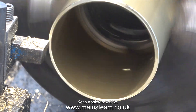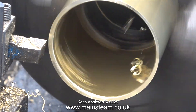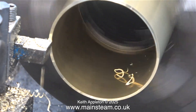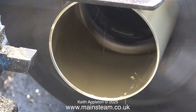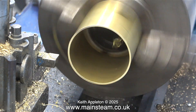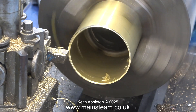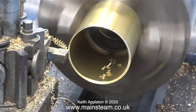To ease the monotony I thought I would true up the first cut tube. As you can see it is shorter but I still need to take very fine cuts. Patience is a virtue as the saying goes, and to be honest this is quite relaxing to do — that is until you overdo it and the tube jumps out of the chuck and becomes very mangled. So my advice is just take it easy, remove a little bit at a time, and you will end up with a nicely finished part instead of a piece of scrap metal. When jobs are going well it is easy to get carried away and think you'll just take a little bit more off, and then it all falls to pieces.